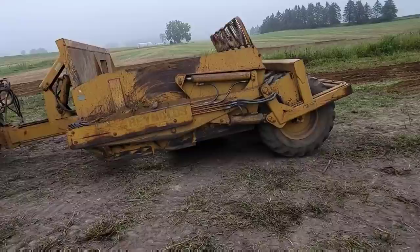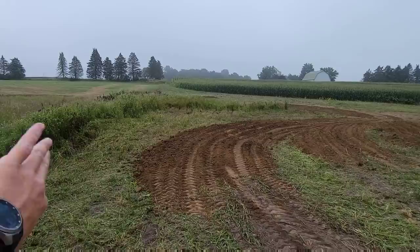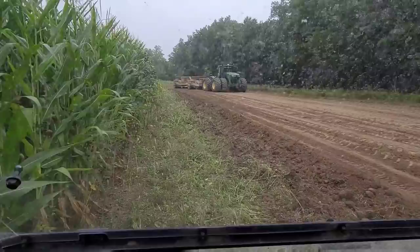Go back and do it again. We'll go watch him from the gator. You'll notice there's some of those weeds that I did not mow down yesterday because it was too wet to get in there, and dad is not going right through the middle of it with the pans in the big tractor because he'll get stuck. So that's why we're kind of piling on the edges. He's going to make a big mound here and then use the backhoe to push it in and feather it in from the edges rather than just dump it all at once.